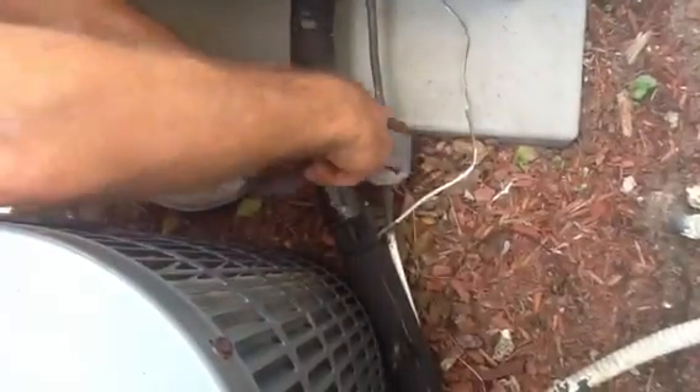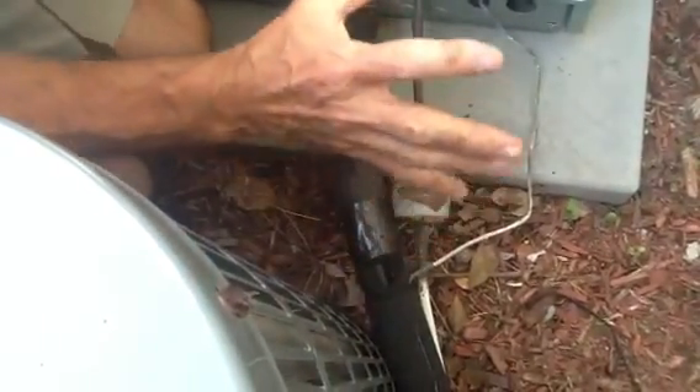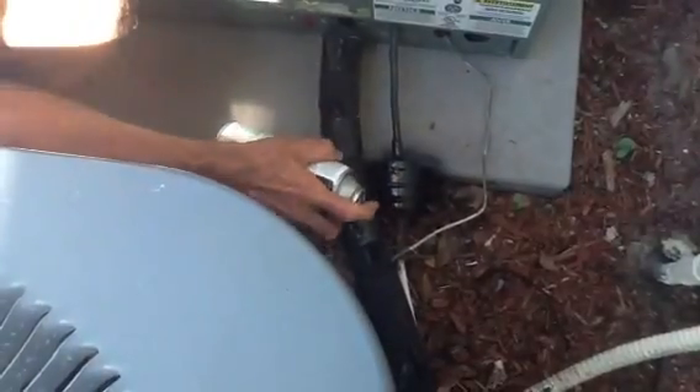It will cause a leak in the refrigeration line. Now I've taken off most of the rust — you can see some bare metal and a little bit of copper shine. I'm going to spray this now. You're not going to get every bit of the rust off — there's no way you'll get a hundred percent off, or you'd sand through it. But whatever you do, it's going to extend the life of this filter dryer at least two or three years.